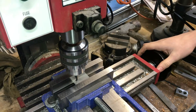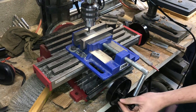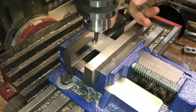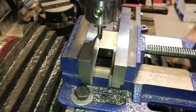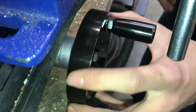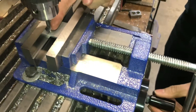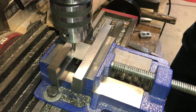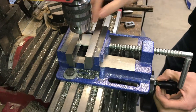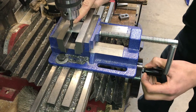What I'm going to do is crank my Y until I hit my fixed jaw with the center drill. This center drill has a quarter-inch body, so as soon as I hit the side I can set that to zero. That means I am 1/8 of an inch off of my fixed jaw, which is the same position as the top of my part.